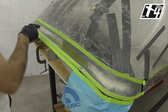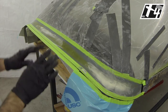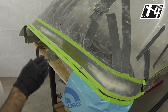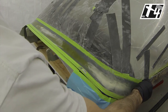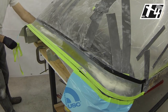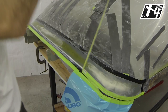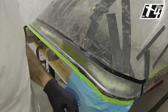We've added our filler in the low spots to bring it up to the surface that we want, and also put on a heavy brush coat of resin — not so heavy that it sags off, but heavy enough that it will stay in place, fill most of the pinholes, and leave us with a nice surface that we can finish sand. We put the masking tape on beforehand so we can peel that off, pulling it back over. That will leave us with a nice edge that will enable us to sand it easily to a feather edge.